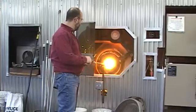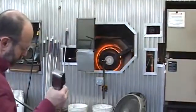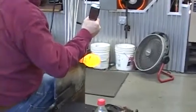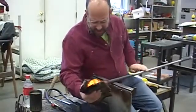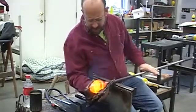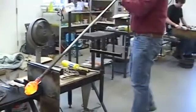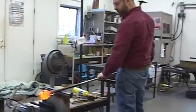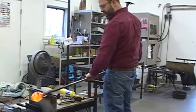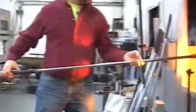Now the core of this is still a little bit cool, so I have to reheat it before I can blow it anymore. Because I want the bubble to be fairly round, I want to make sure that I have my exterior shape established before I begin the blowing process. I've blown into the pipe and trapped the air under pressure with my thumb. The air, wanting to lower its pressure, can only do that by expanding. If the glass is soft enough, the air can expand the bubble.